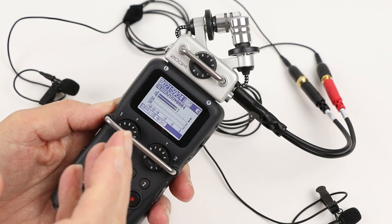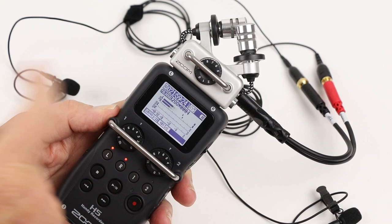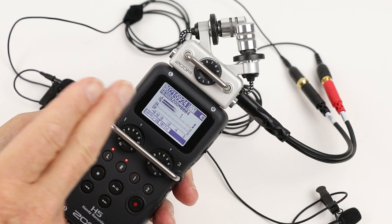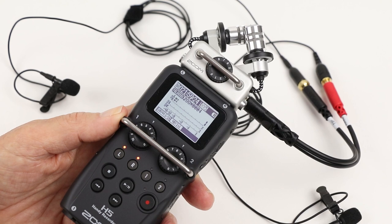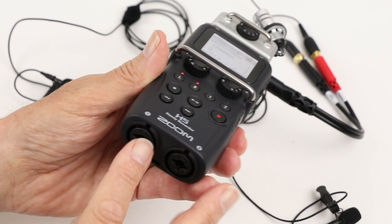As with any testing of microphones and setting them up with the right gain, you need to adjust the gain so that the level does not go past minus 12. That's just a goal level — some people say you could go a little bit higher than that, but in practice I've found that minus 12 is a really good peak level. This is a good recorder with a very low noise floor, so even if you have to lift up the gain a little bit in post-production, it will still be a nice, clean recording. So that now gives you the ability to plug two microphones into that single stereo channel.